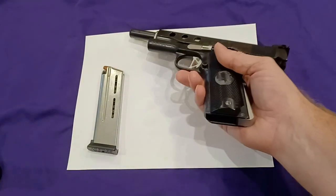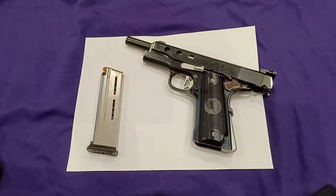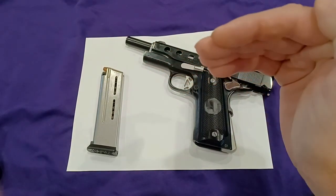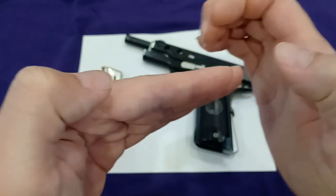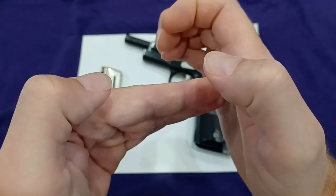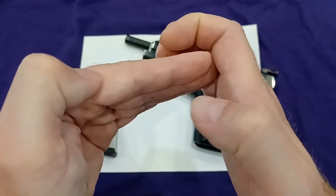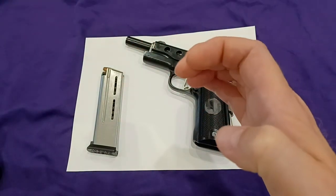We have different feed particulars with a smaller caliber — calibering down something that wasn't designed to be a 9mm. On a .45, the way that gunsmiths historically fit the extractor claw, you can imagine this being your extractor claw and this being your case rim to your .45 — they would fit it where the pad of the claw would just make contact with the shell, and it would be pressed against the slide and held there. So when your ejector hits it, it comes out the ejection port.